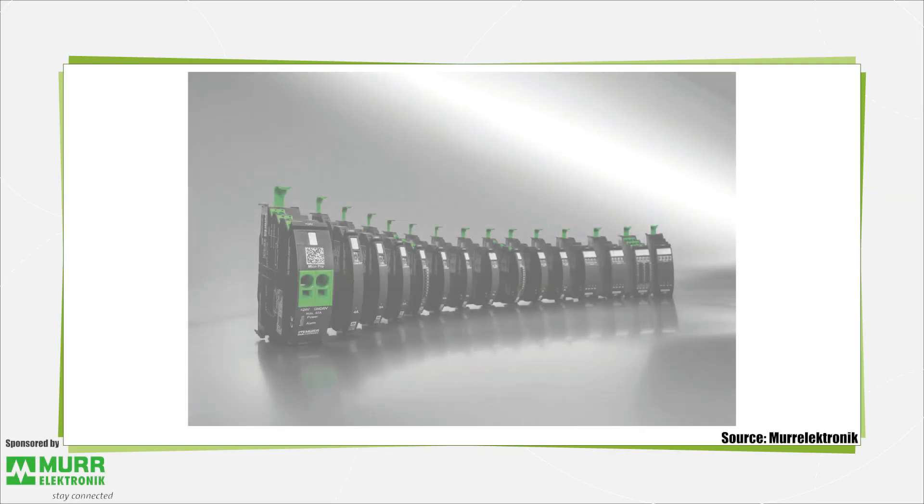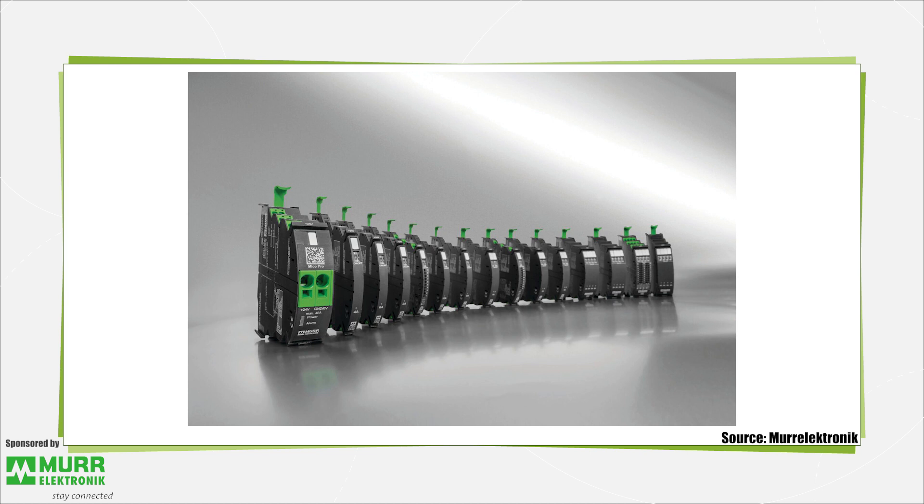There's a big difference between how an electronic circuit breaker operates and how conventional circuit breakers function. The claim to fame of electronic circuit breakers is that they can be set up to trip in a few milliseconds when they see a short circuit. They can even be set up to trip quickly when they see a resistive short circuit, as might happen when there's a problem at the end of a long run of cable.